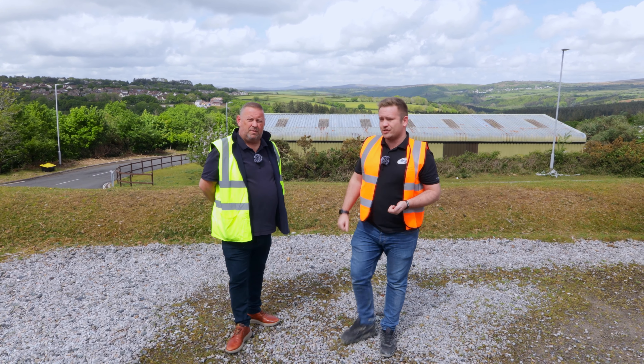We do lots of different types and different sizes, and we're looking at expanding our range in the next couple of months. It pulls through and then into a hot foil printer which prints the character — like number one. The wheel's heated up and prints onto the material, and we cure it by heat which seals in the print. It's rough going in and quite smooth when it comes off. Then through to the cutter, where we've got a camera set up to make sure we keep the image in sync, so the material cuts in the right place and we're not getting missing or half characters. And there's the finished product with the numbers on there.